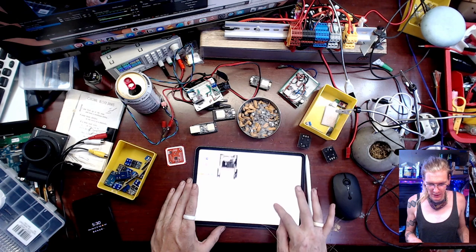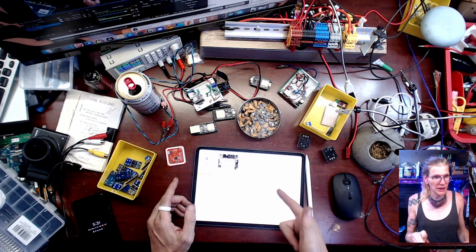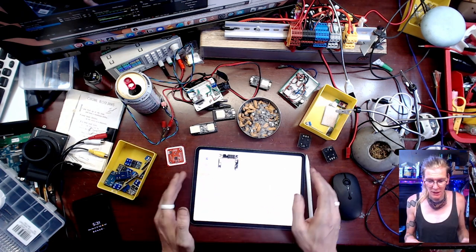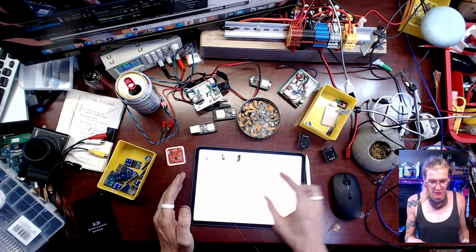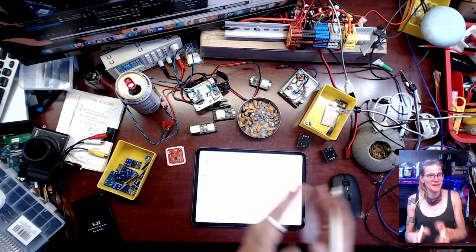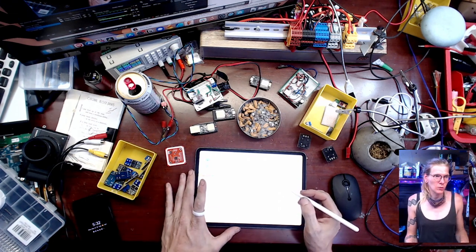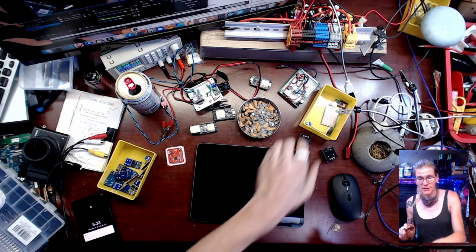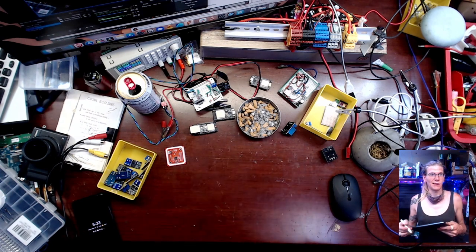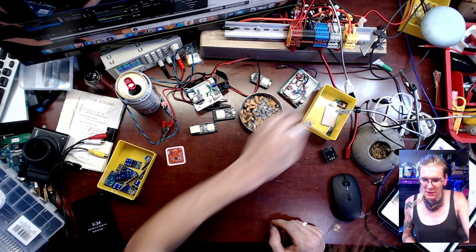And then over here, the 24 volts is also coming into the power buck converter, which will take anywhere from like 32 down to 12 volts, and then bump that down to 5 volts to power this board. And then the 24 volts is also going directly into my stepper controller, because we're going to open the door with a stepper motor. This has to get me to the step that I have the motor in, and then can start making something that may or may not work with what I'm trying to do here. The latch just needs a relay, and we have that already, but that's going to be part of this new controller. And then keep this open so I can see what I'm working on, and where I decided everything's supposed to go.